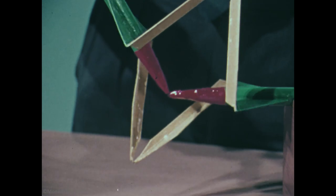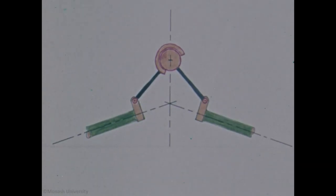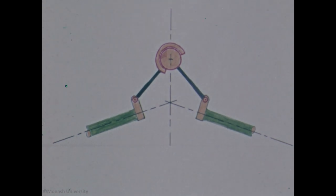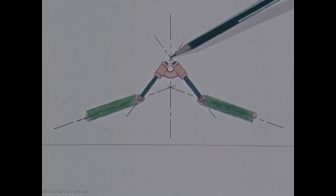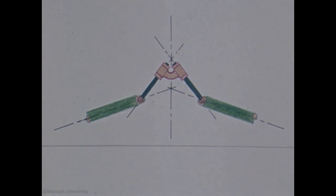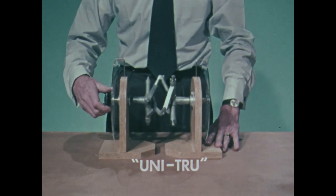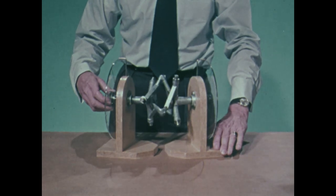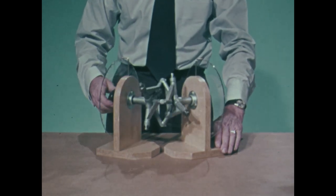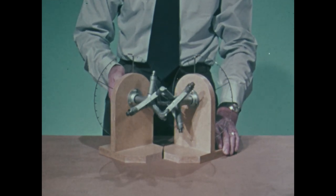This cardboard model demonstrates the Clements principle. One can modify this coupling, as Clements himself actually spotted, by suppressing one of the three rotary freedoms of the ball cup and replacing it by two carefully placed hinges. When this design is tripled up, you get the recently made Uni-True coupling, manufactured by Southwestern Industries in California. This particular Uni-True model, which is a bit spidery and intended only for small torques, transmits uniform drive through a full right angle. It was designed for precision purposes with almost zero backlash.